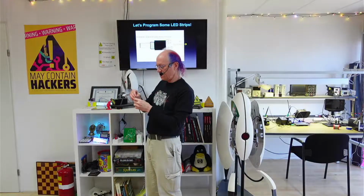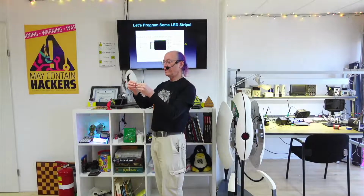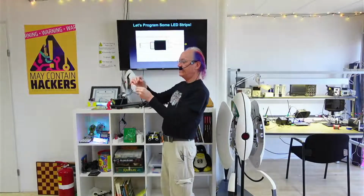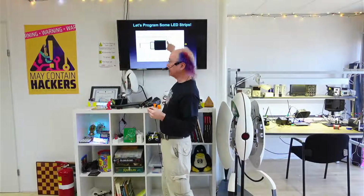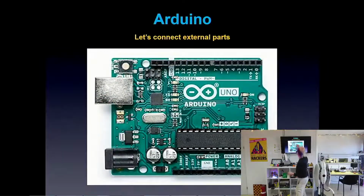And that's what I'm doing here. Now these are kind of loose, so they will fall out if you're not careful. And then these 3 wires go to the connector with the same names on them on your Arduino board. So let me go to that picture again. Here's ground. There's also a ground in these 2 holes. A5 is over here, and 5 volts is over here. So I'm going to connect these up like that.